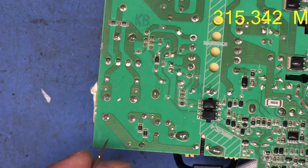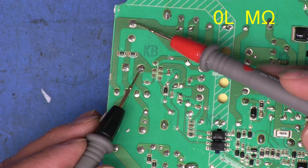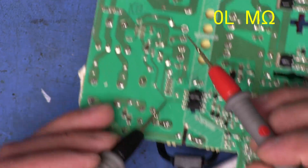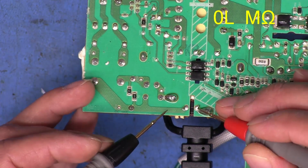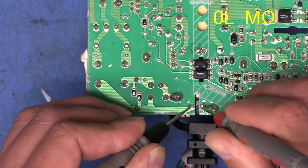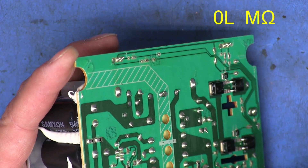Before I remove that stuff, let's check the fuse and see if it's popped. It's possible that if this exploded really quickly it could have just been the charge from the capacitors that caused it to blow to pieces, and if it was quick enough it may not have affected the fuse. Let's see what we have across the fuse. Yeah, that fuse is gone. All right, so out comes all of that stuff.